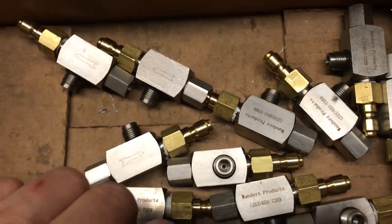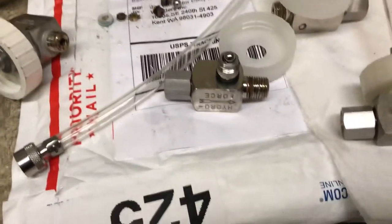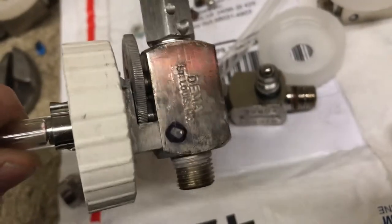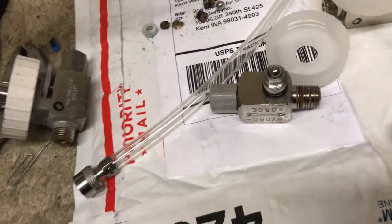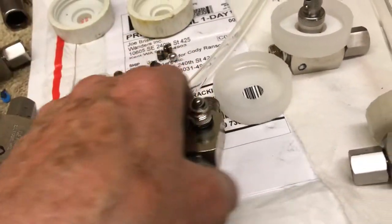We're getting away from brass — all my injectors are stainless. All the injectors that came in — not every injector I make, but all these others — are brass. It's not a big deal but when you look at the life... this zero-marked one is actually still drawing great, might get a couple more years, but that opening flunked. Here's one that flunked. And here's one doing great — three years of life. That's a Hydroforce, an old injector but it's got plenty of life in it.